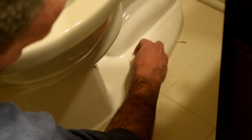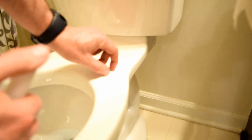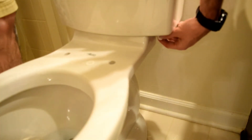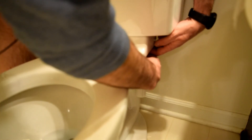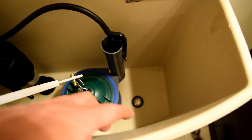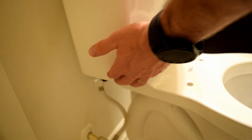This particular set came with a special tool — these two pieces go underneath, and then this piece goes on here, and then underneath we put the bolt on to hold the toilet tank in place. You'll probably need a screwdriver in the top. I made sure that each of the bolts — one on the left and one on the right — are nice and tight, and that's what holds your tank onto the toilet bowl itself.